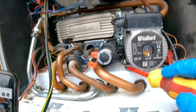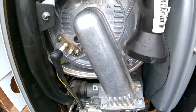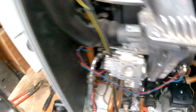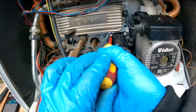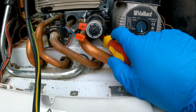For the divertor we have three screws: one, two, and one right at the bottom underneath here. Now, depending on the boiler, some might have a long screw for the bottom to make it easier, some might have a short screw — it depends on what you've got. We're going to start undoing these screws and also the one on the bottom.